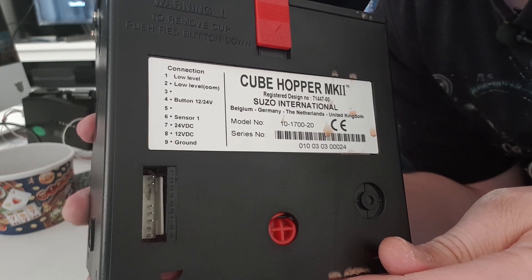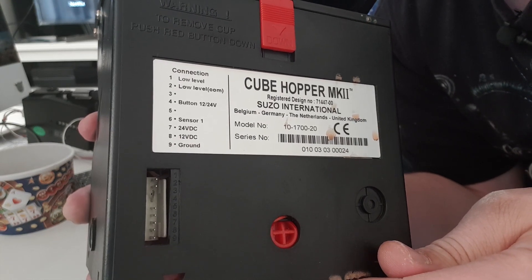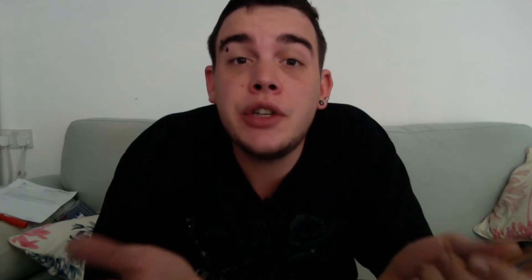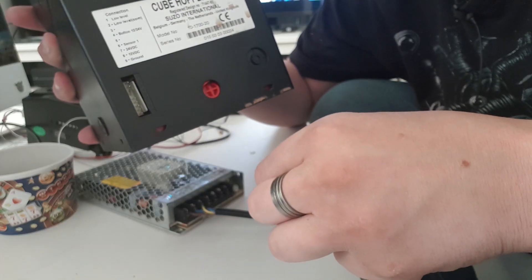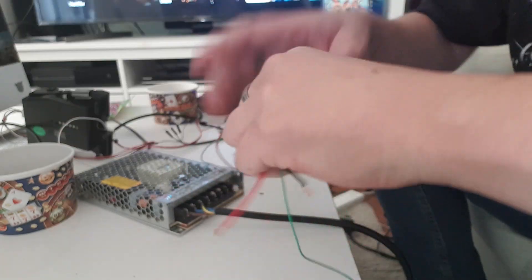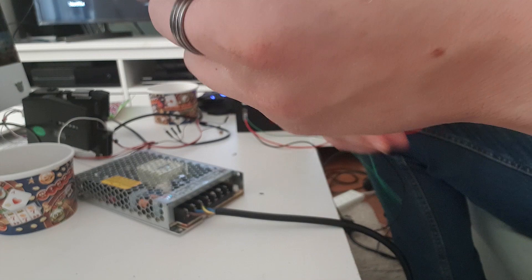The 24 volt is on pin seven, which we're not going to use. The sensor pin — probably one of the most important ones — is on pin six. I choose to make a more permanent fixture that also allows me to pull the plugs in and out as necessary. We're going to want a good length of wire to allow flexibility; we can always trim it down later. The green wire is the longest, and we've got our red and black wire — just trim the ends off those.